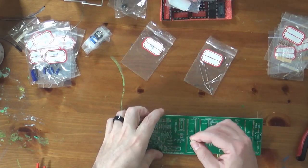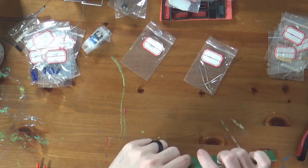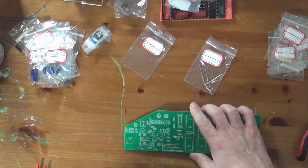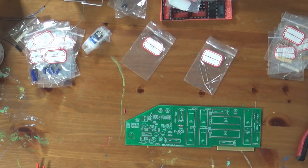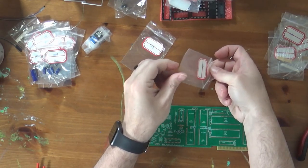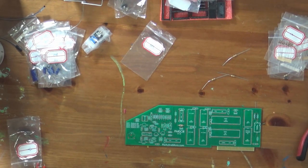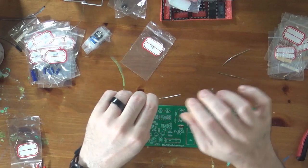I do like to keep my resistors all aligned the same direction. So the way it works in general for resistor color coding is that you either have three, four, or five colored bands designating the value of the resistor. The last band is the tolerance. So these resistors are gold banded, which, wait, off the top of my head, I think that's 20%. I forgot. The gold band is general purpose, is what that comes down to. They are not precision resistors. Okay, so gold band are 5%. So I was off by a factor of 4. Yeah, close enough. See, I do correct myself.